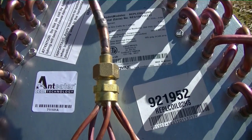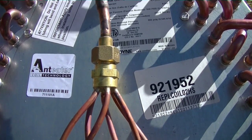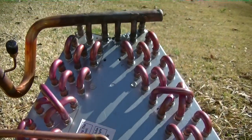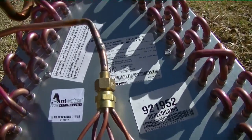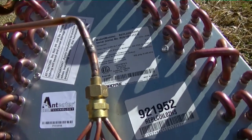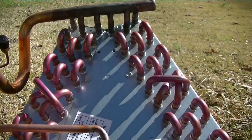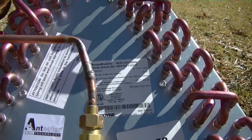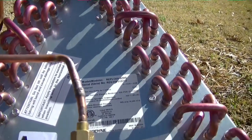I'm using a retrofit for R22 for the first time. This is a 70-something-year-old man who doesn't want to spend all his money on air conditioning — he just wanted a new evaporator so he could have heat and air, since this is a heat pump. I always swore I'd never use a retrofit refrigerant, but I've seen Zach use it a couple of times and he's had good luck with it. R422D came highly recommended and it's at a good price, so we're going to try it out.